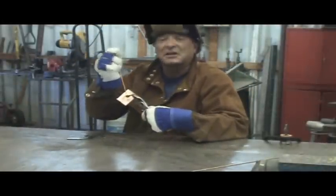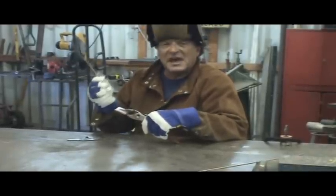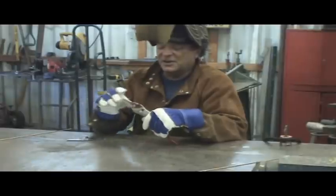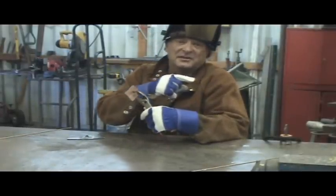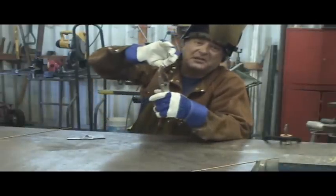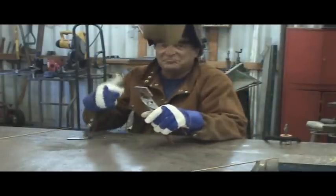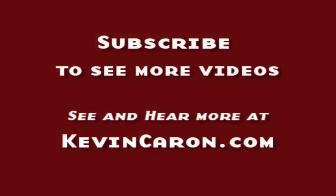And as for the copper, it just wound up with just a little burn mark on it — that'll just buff right off and you can use it again. Great thing to have around. You know, little different size sheets. You can get some of the thinner sheeting. I've even gone so far as to take a thin sheet of copper and a couple of rare earth magnets. You can put one piece on the back side of the copper, the other piece on your steel side, and they'll clamp together when it's so far in you don't have a clamp that you can reach in and do it with. Good thing to do, good thing to know. I'll catch you next time.